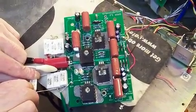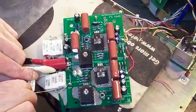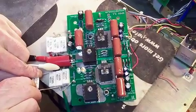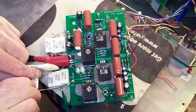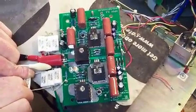1.2 amps, and it's at 14.99 volts with approximately 30% more load, so that's nice load regulation. And my fingers are getting a bit warm on this resistor, so I'm going to keep them on there.